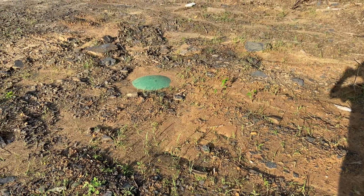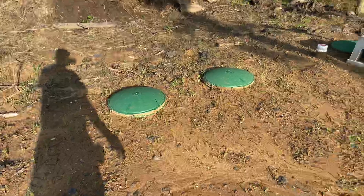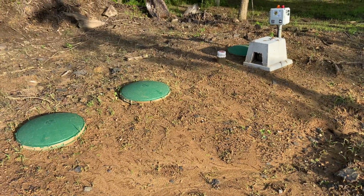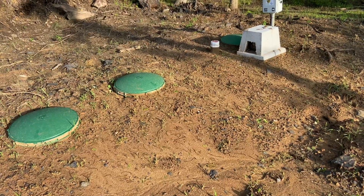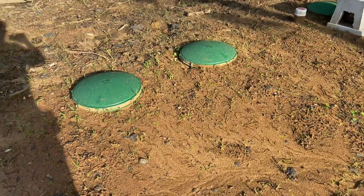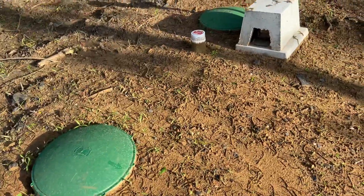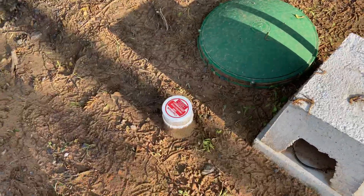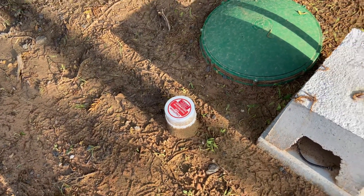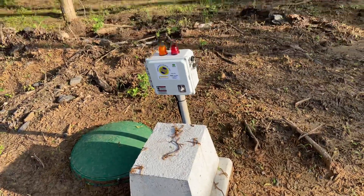So that first cover you see there is the 1,000-gallon septic tank, and right here is your more traditional aerobic system. You've got your primary tank, secondary tank, tertiary tank, the final tank, a cap where you put bleach, and then here's the pump with the concrete doghouse and the controller box.